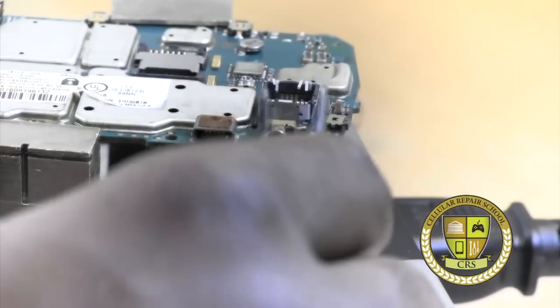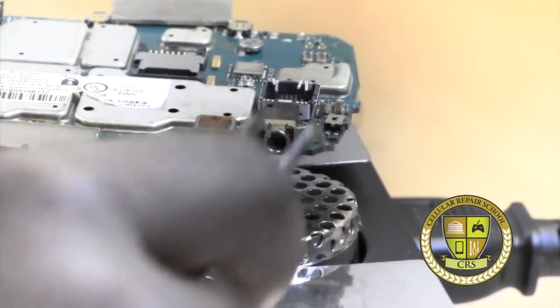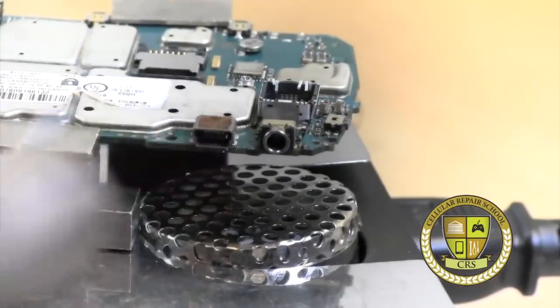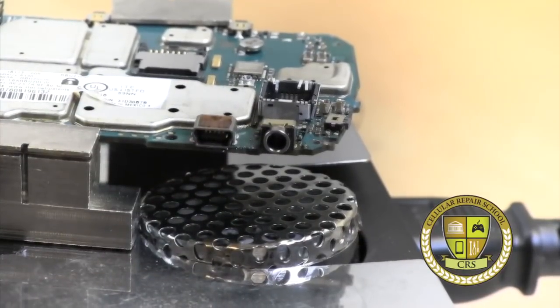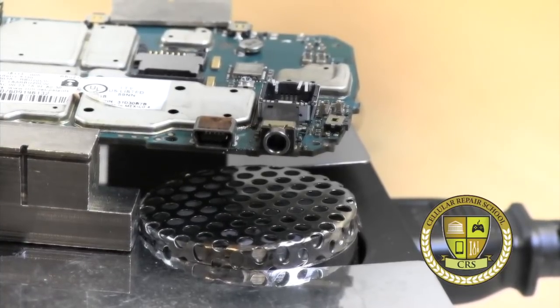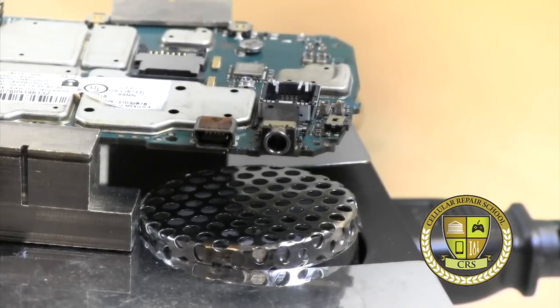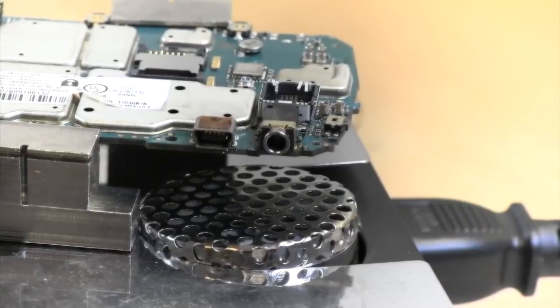As you also saw, we never even covered up this audio jack, which is totally plastic, and we didn't have any chips that moved — everything was pretty much okay. So what we would do is take this board, reassemble, and let it cool. Give it about ten to fifteen minutes to cool, maybe even longer. Then plug in your charger and see if it works. This is William Agnew — this has been a charging port replacement training here at Cellular Repair School. We'll see you guys in the next training.